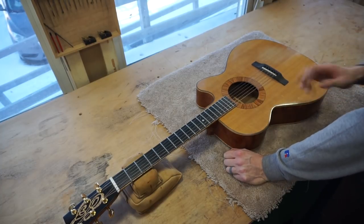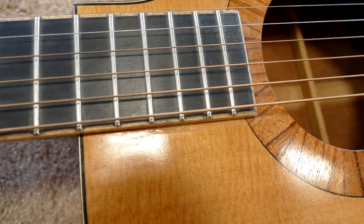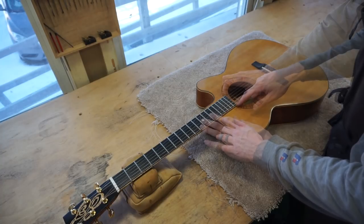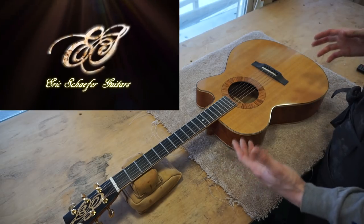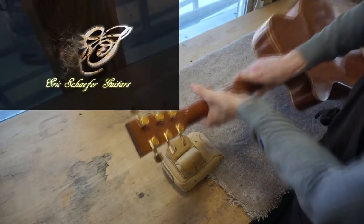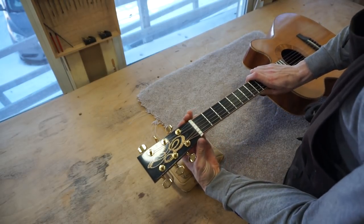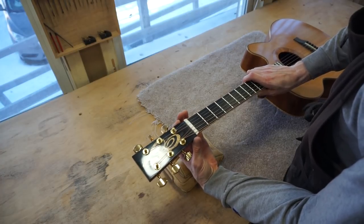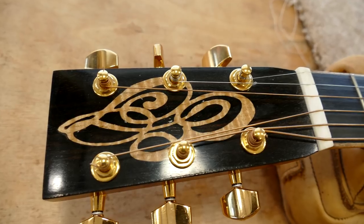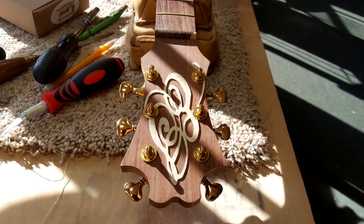The finish is pretty shoddy all around, especially near the bridge and fretboard tongue — though finishing around those areas is genuinely difficult to master. If you follow my finishing course I can show you the correct way. The headstock shape is kind of small and transitions poorly into the taper of the fretboard — there are almost no cheeks on the headstock. Because it was so small, I had to alter my inlay design; the wing elements would have run off the headstock, so I had to remove them and it doesn't look as nice as my inlay normally does.